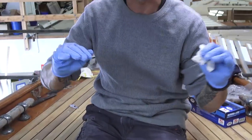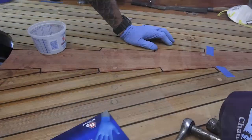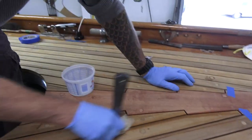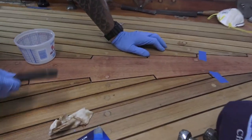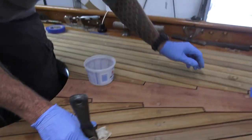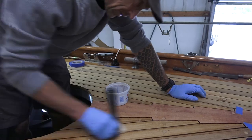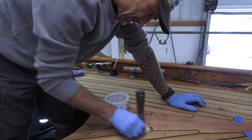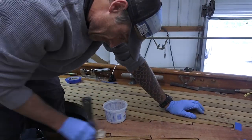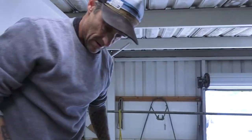We cleaned it really good but there's always a little bit of a drip — makes this shiny surface. We sanded all the amine blush — that's what the shiny is on the epoxy after it dries. It's kind of waxy, you can't really paint over it or stick epoxy to it unless you sand it. So we sanded that off and now we're just doing the acetone wipe for the oils. We've done that and we're going to start caulking.